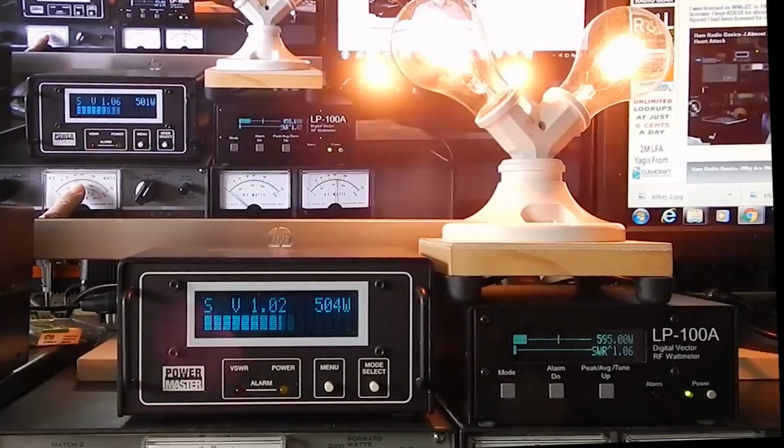And if you've tuned up the amplifier for 400 mils peak plate current, but you're actually peaking 500 mils of peak plate current, what's happening? Well, probably splatter, distortion, and other things. And you may not be aware of it. In your headphones, which are sampling in the transceiver at one of the audio stages, it sounds fine. What's coming out of the coax connector on the back of the linear amplifier may be something very different.